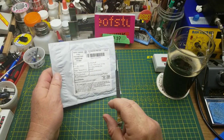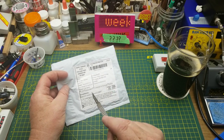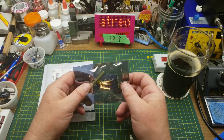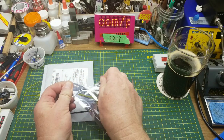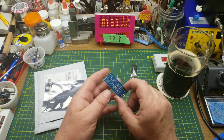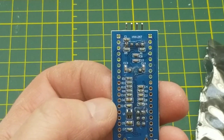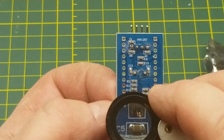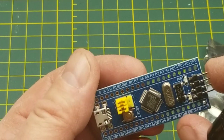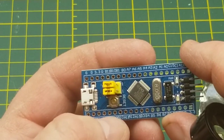Now the part I've been waiting for — stuff you guys sent me. I have absolutely no idea what this is or who it's from. This one claims to be an expansion board module. Oh hello — that looks like a nano, but is it? Nice yellow header pins. On the back it says HW-267. There's probably a voltage regulator, a bunch of resistors, and capacitors. There's a reset button and a couple of jumpers — which is not what you'd normally expect on a nano. There's also an 8 MHz crystal.